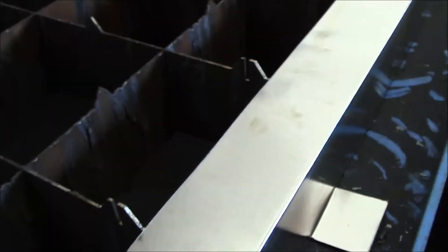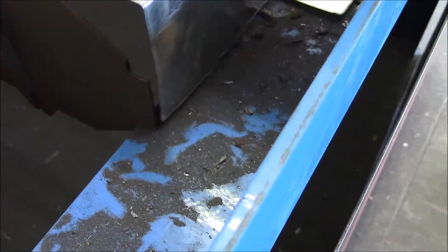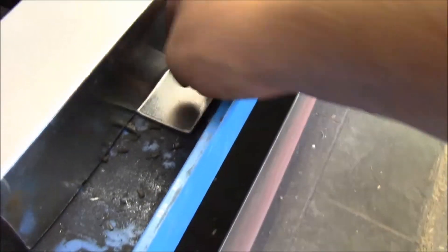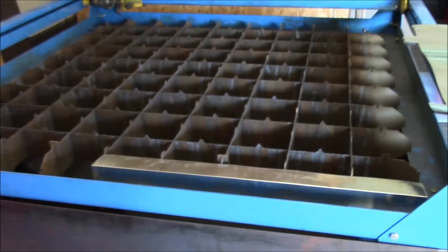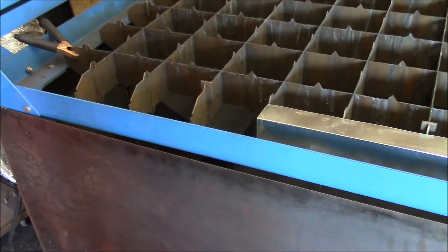Here's the idea: the material sits on top of these points. This is a half inch out, so there's still a little bit there. I've got it so that it pretty much lines up with those two points, so it'll just kind of sit on there. I might not even have to tap these, but at least it'll give it a leg to sit on. The reason why I made them this way is simplicity — I need to go more than the length of the table, so 48 inches. If I have two of them, I can just put them on there, overlap them, and spread them out until I get what I need. Now I've just got to bend the rest of them.